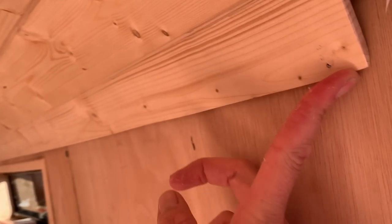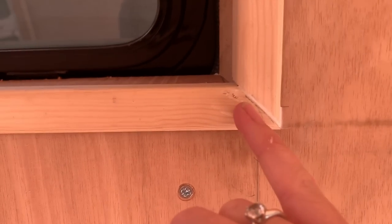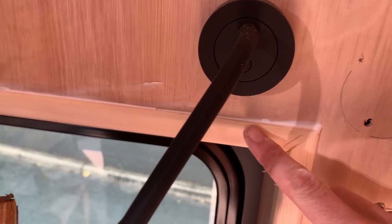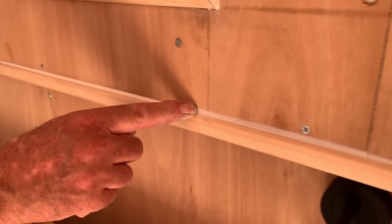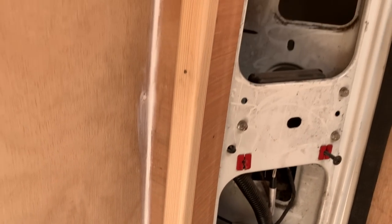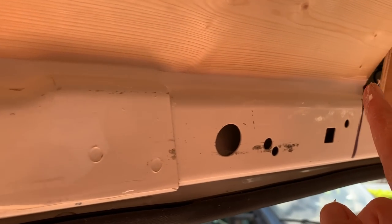You can see how it's chamfered at the back. So now Dad's going to run some caulking underneath this bottom bit to edge it off nicely. While we had the caulking out, I've done a couple of these corners which weren't very neat — filled in this one, filled in this one that's on the wonk, and there were a couple around the window that weren't exactly perfect. So I've filled in the top of that, down there, and that bottom one. We decided while we had the caulking out just to do every little gap we could possibly see to make it all look neat and nice. I've filled in some screw holes as well and finished off the edge of the cladding above the door. Somehow that's the whole day gone.